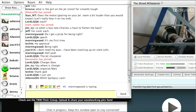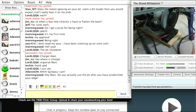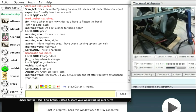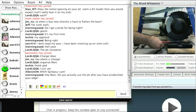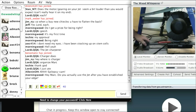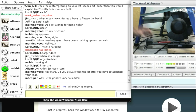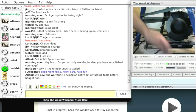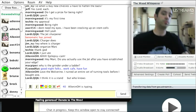It's just a standard grinder with the Wolverine system mounted on the base — that's the metal piece with the red handle. This arm goes into the jig and your turning tool sits in here, then goes up to the sharpening wheel. There's also another accessory for turning gouges called the Vari-Grind, which helps you sharpen bowl gouges much more easily than just using the handle alone.